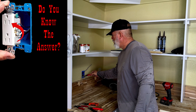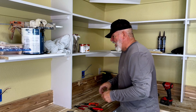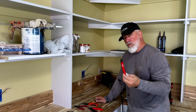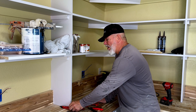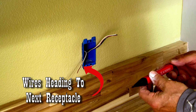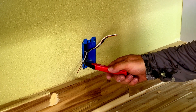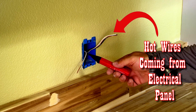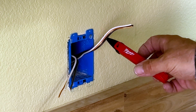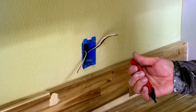Sometimes you'll hear a little beep, and that usually is coming through the neutral or the earth ground — it's just a trickle. But if you hear and see your tester going crazy, it means there's still power there, so be very careful. I've left it live for a second so you can see how this reacts. This one should be dead — we have nothing. When I get near the black wire, that is what you are looking for, and you know you still have power.